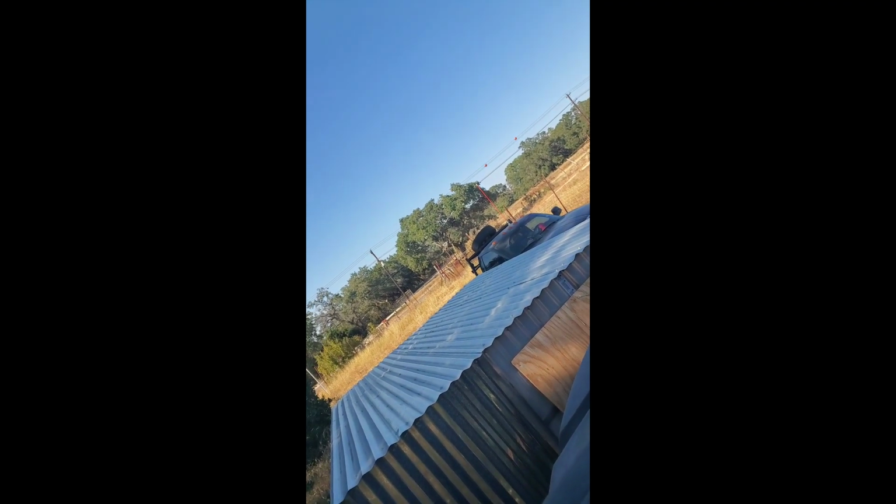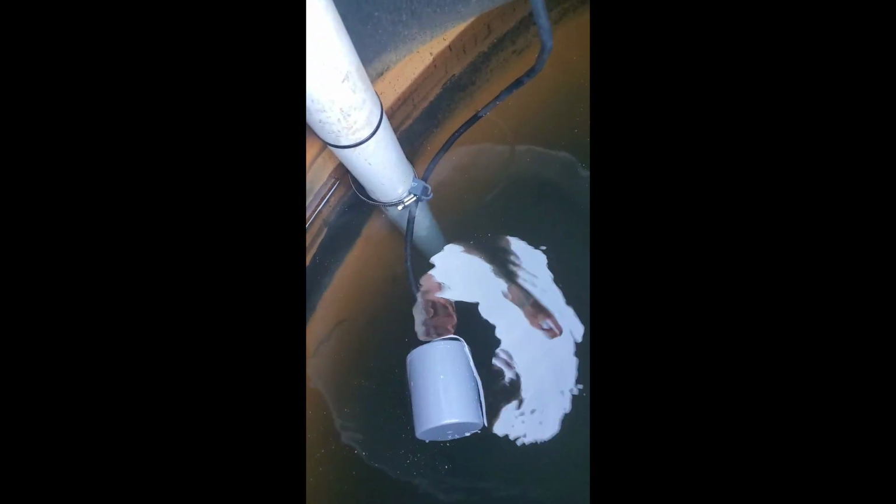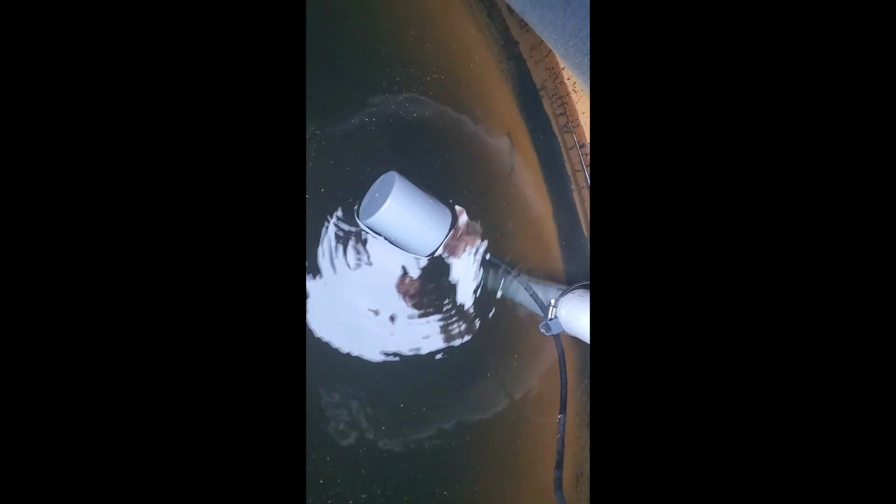That was an initial setup, just to get this project going right away when I put this big water tank in. But the problem with it is that the well runs constantly. It's cycling on and off, on and off, all day long. Every time you turn the faucet on, water drops, and the well pump down in the ground 300 foot below kicks on and off.